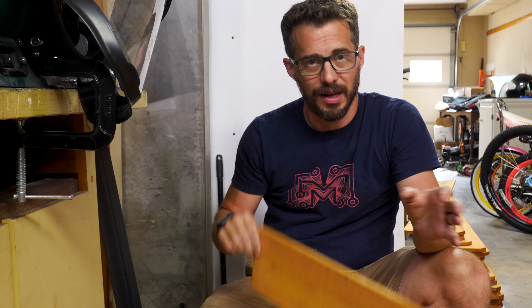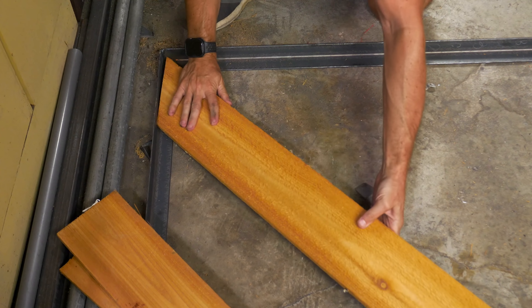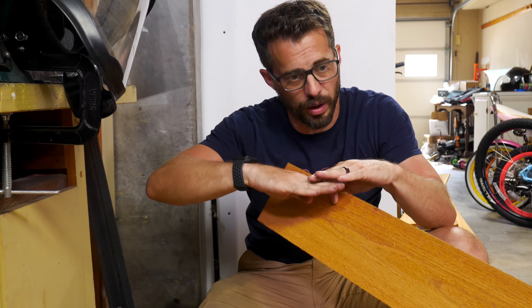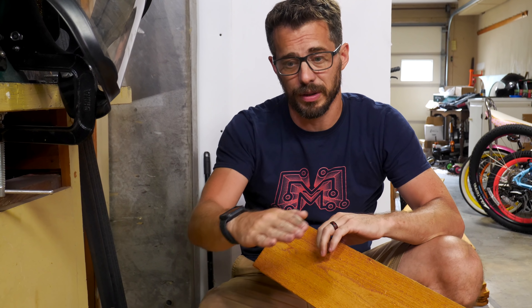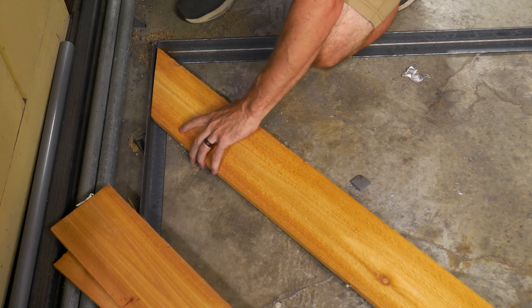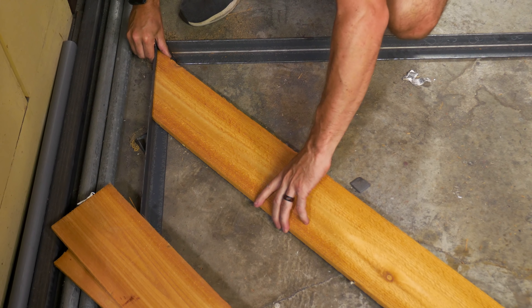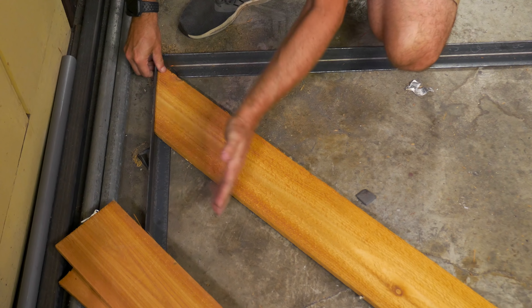To get the chevron pattern, I have to make sure that the wood starts in the same place on both doors. I'm going to start with one of these pickets, cut a 45-degree angle on it, and stick that in the corner. From that piece, we can work out in both directions. So theoretically all the pieces should be at 45 degrees, and the ends of them should line up with the ends of the pieces on the opposite door. We just have to make sure that the cut edge is up against this outside face, and then we can work from there.